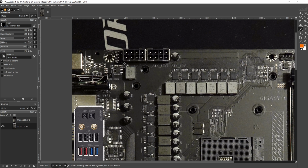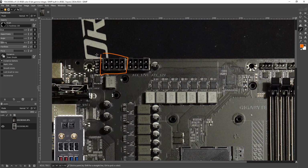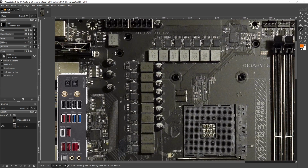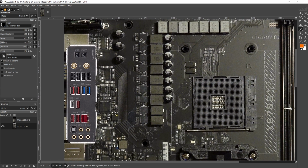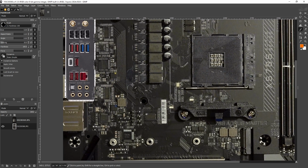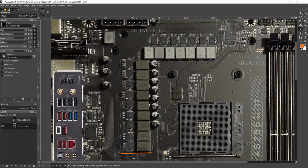Because for comparison, GPU 8-pin power connectors only have three 12-volt connections. Motherboard 8-pins have 4 of them. So these are actually about 33% better than GPU 8-pin power connectors, which, I don't know why GPU 8-pin power connectors are designed like that either. Seems like a real waste of pins, but anyway. Actually, I do know why. It's for hot plug functionality, but when have you ever seen it? When has anybody ever used that, I guess, servers?